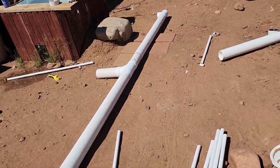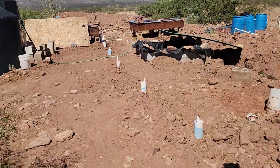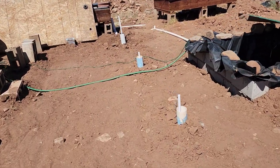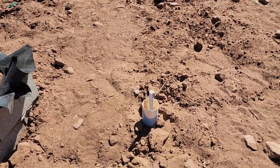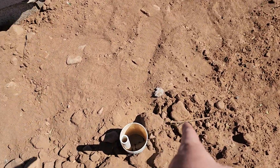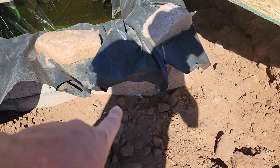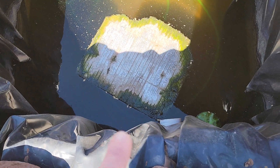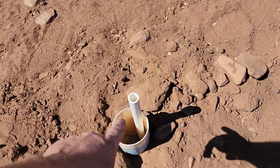We've got the last piece of pipe laying out. I had to stop working on this and do something else. We've got all the stand pipes and the 4-inch drain on this side all buried and tested, and everything drains properly into the sump tank. Right here there's a T that goes that way, and that goes underground down here and into the concrete blocks and comes out right there. There's a 1-inch piece of PVC pipe inside there as well that will come out and then go down into a pump.